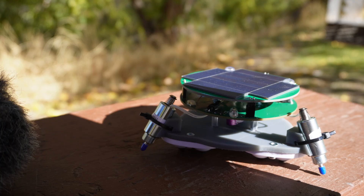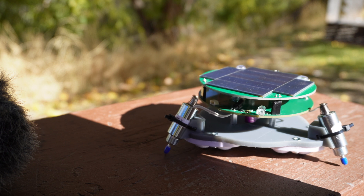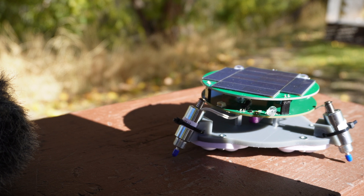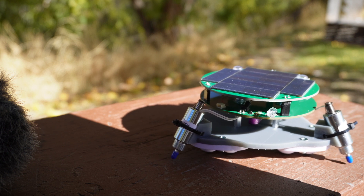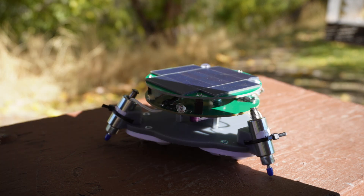Outside, it turns on about every two minutes in full sun and plays for about eight seconds using a 0.6 farad supercapacitor — I could have used a larger one to extend the time. In partial shade it does charge noticeably slower. It did move itself out of the shadow — I'll consider that a win. The issue is it gets stuck on any little bit of texture or curvature in the surface.